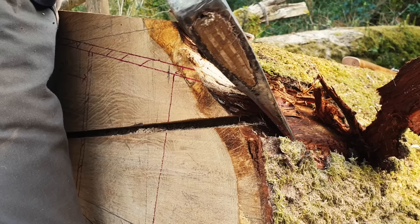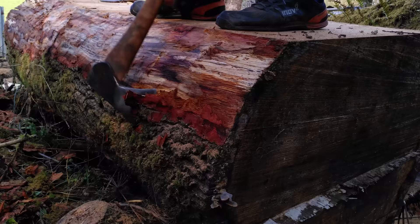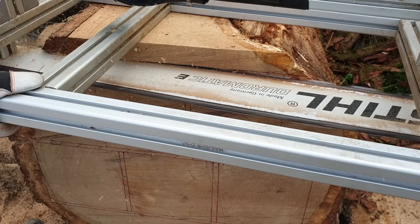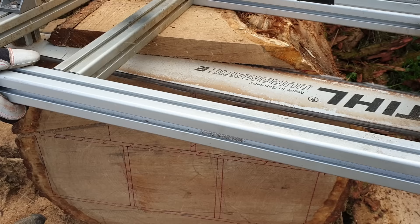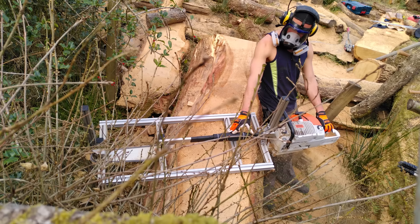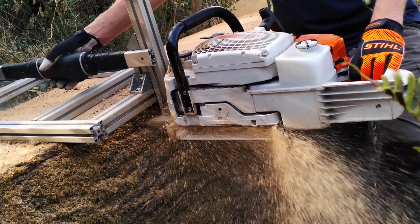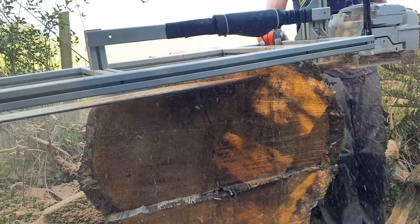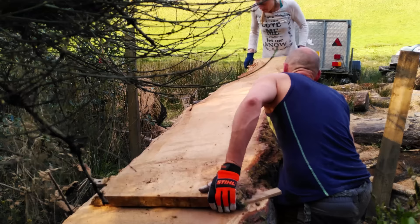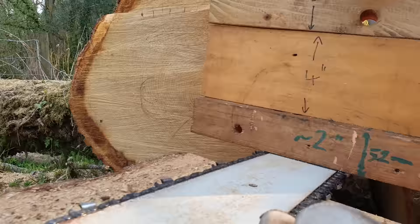Like a lot of woods considered durable, the sapwood of oak is still very attractive to insects and bugs and is just much less durable. In the process of chainsaw milling we'll be removing the sapwood and the bark, leaving nice solid heartwood. The reason for removing the bark from one side of the log is that it gets pulled all the way through the cut by the chain — removing it limits the potential damage any bits of sand or dirt on the bark will do, so your chain stays sharper a bit longer. In fact, if you're using any kind of wood, you probably want the bark removed as this is where the majority of bugs will get a first foothold for their attack on the inner post.